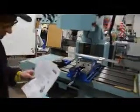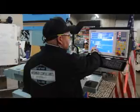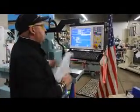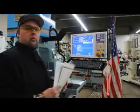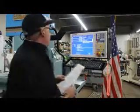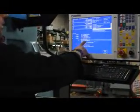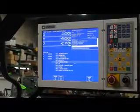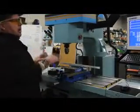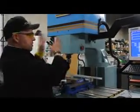I'm going to have you step back and take me to the controller a little bit. I'm coming up on line 146. I'm going to bail out on line 147 due to essence of time. You'll note on line 146 that's T2S3000 — so that would basically mean I've done my pocket, my boring, done my first steps. I'm getting ready to do a tool change to go to tool number two. In this situation, we're just going to run tool number one. The neat features about this machine with this controller — let's run through them really quickly on the bullet points.